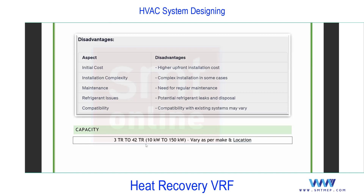Additional unit conversions: 1 TR equals 4.7 HP. Verifying: 1 kilowatt equals 0.28 TR — first conversion. Second conversion: 1 TR equals 4.7 HP. Also important: 1 HP equals 0.21 TR — just the reverse. That is, 1 divided by 4.7 gives 0.21. These conversions are important to note, especially since outdoor units in VRF systems are often rated in HP.